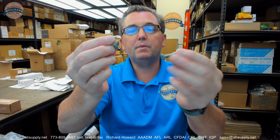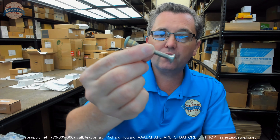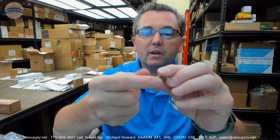The door side is meant to be through bolted. We are going to have the through bolt — this is what would be called a TBGN. Through bolt and grommet nut is what this is known as in the industry. If you use the abbreviation TBGN, this is what you mean. This is nothing other than a quarter-twenty machine bolt with an oval head, and then the grommet nut on the other side.